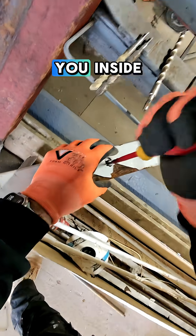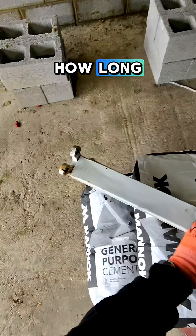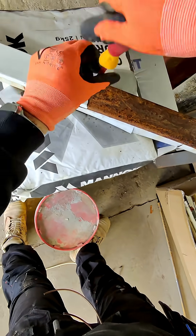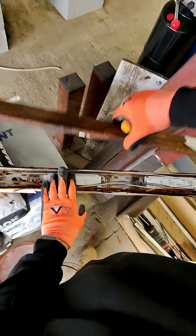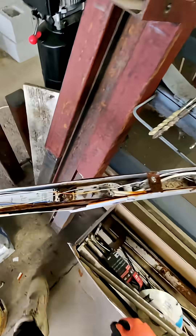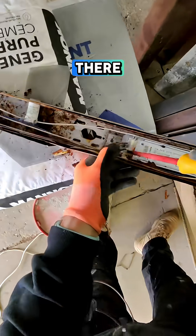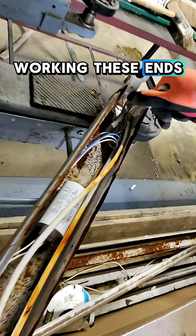Let me show you inside this fitting — nothing when I put it in there. Inside this fitting, because it's been up a little while, this is what happens to a fitting that's not fit for the right environment. I can see why they've done it because they're probably half the price, but look at that — everything in there that can cause problems. These little bits of rust can get in there, bridge it out, cause a fire, obviously stopped working, and these ends get corroded.